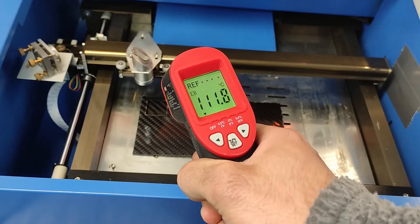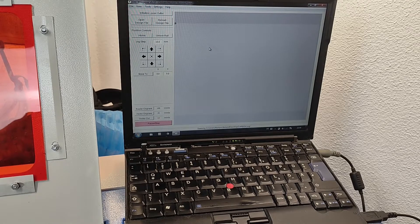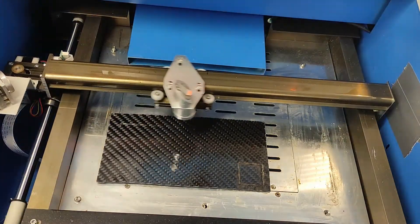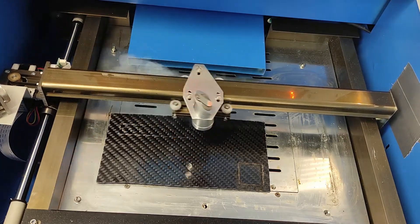Please be careful because the carbon plate can get really hot. I also made a design for engraving, which you can see here, and I lasered with 30mA and a speed of 400mm per second, and that worked quite well.